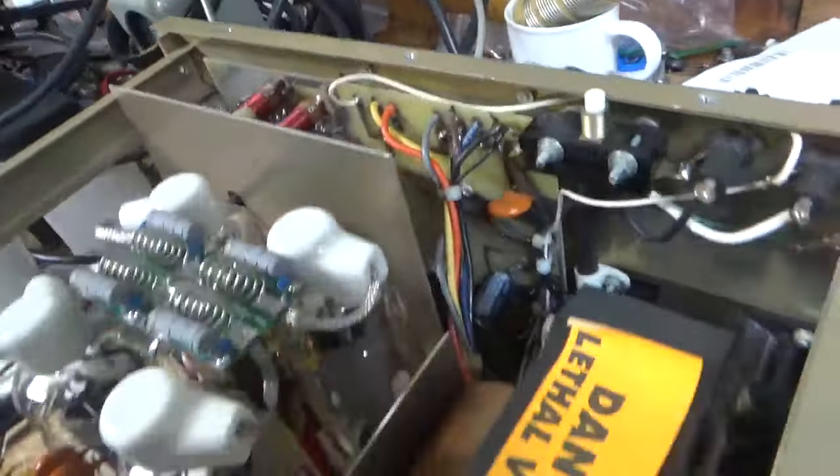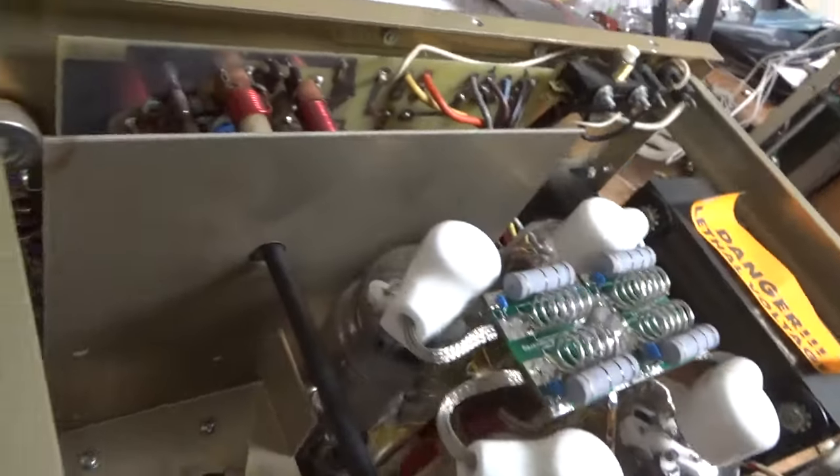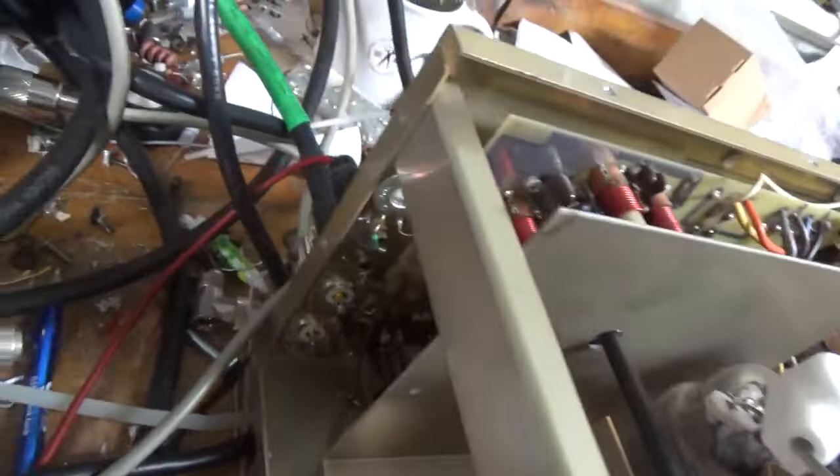Moved the socket assembly. Grounded the grid connection for each tube socket right to the metal. Added the gas discharge tubes below the sockets also. Put in new SO239s from Max Gain Systems. Great people over there. Brand new set of Penta Labs tubes. Awesome people there. Fully trust them fully. I don't say that about many nowadays.